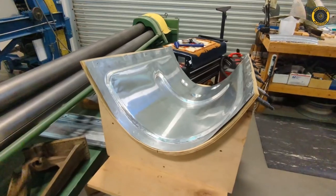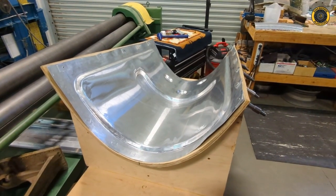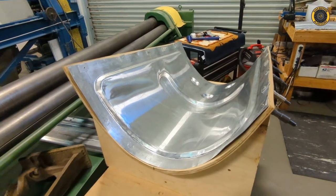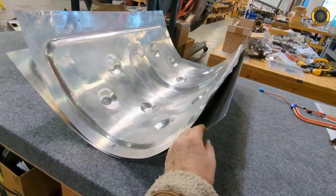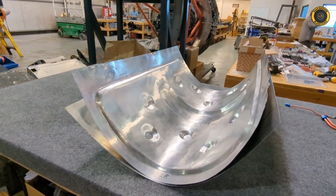This little cutout here is where an automatic life raft was located. The pilot would deploy it from the cockpit, and by the time he got out of the airplane the raft would be ready to go. Here's the inside skin of that life raft cover — the external skin of the aircraft mounts on the outside, and this is all done by hand forming in this jig with hammers. Here's another one of these life raft covers where they're going to get the external skin riveted or spot welded to it.